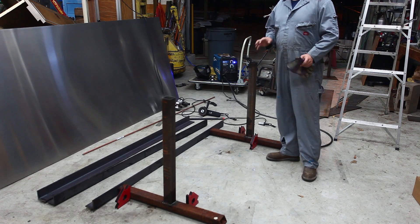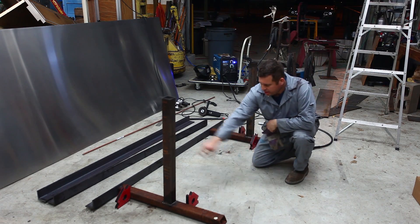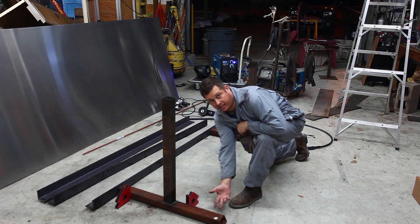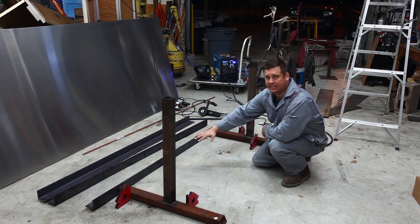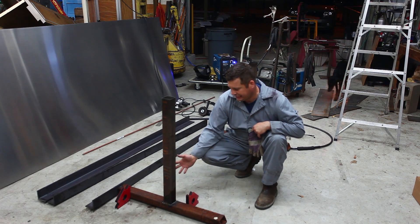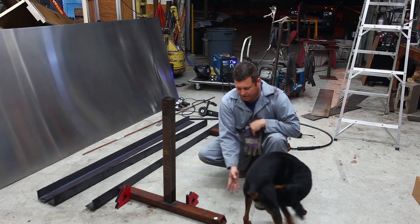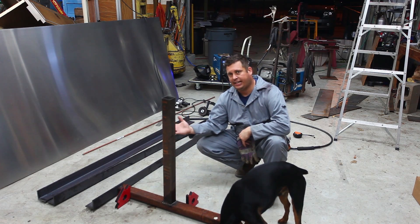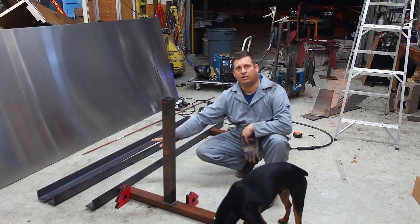I want to talk about assembly because this is a critical section of the project. I've laid out how I want this thing to be welded together. I built my two legs — there's a nut underneath each one, about a half an inch tall, that gives it feet to sit on so that if the ground is unlevel my fixture doesn't rock. I've welded the legs to the bases. I've biased the legs a little bit forward because as I roll up to bend material I'm likely to put pressure towards the back, so having a little longer back legs will be good.